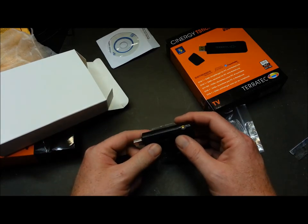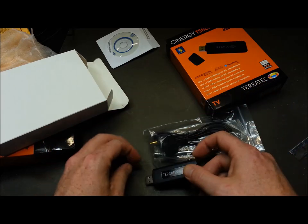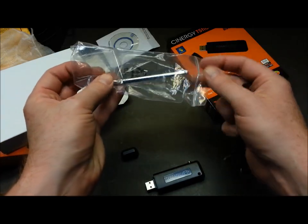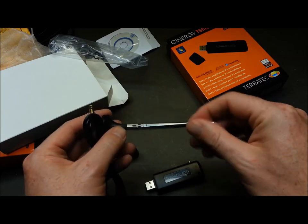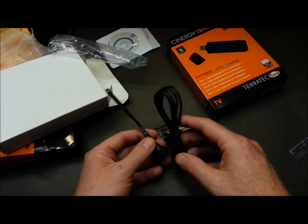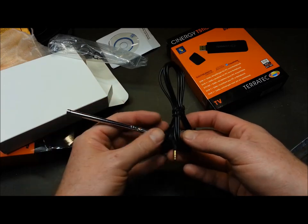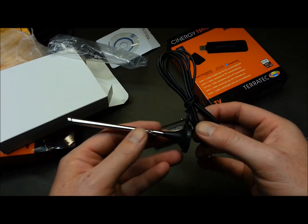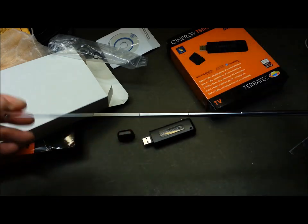I have the Terratec unit with the PAL connector, and this one has the MCX style connector — I really favor those. I don't know why other people don't; I just like it because it's compact and tiny. I like this style of mag mount stock antenna. I'm getting some spares for my carry-around kits — I did make a video recently of my carry kit. First piece of advice: add a bit of glue right there and you won't have the coax pull off the end of the antenna, as you'll see in that video.